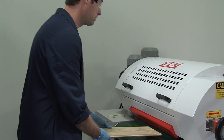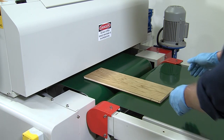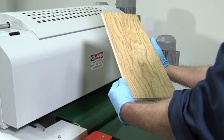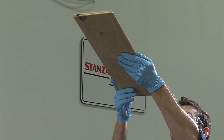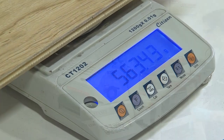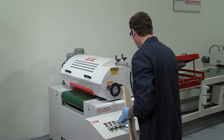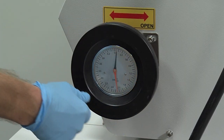A test piece is run. The weight of the coating film is determined by a scale. From the resulting weight, coating adjustments can be determined. These are made by means of the nip, the roller speeds, and the application height.